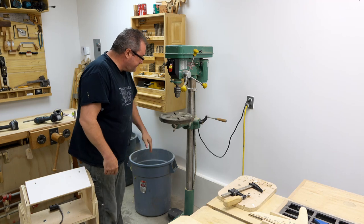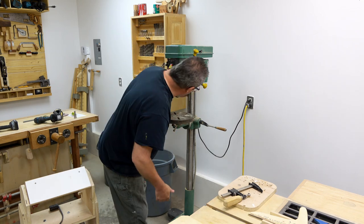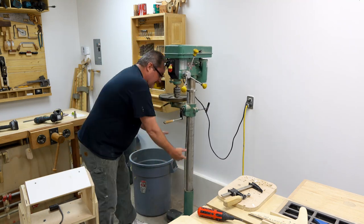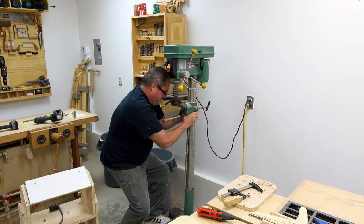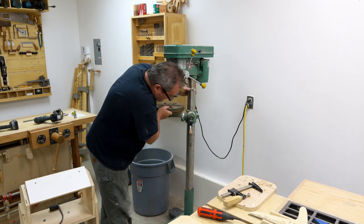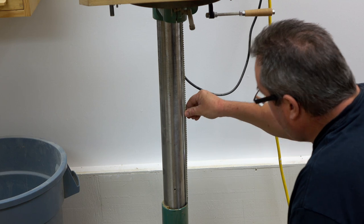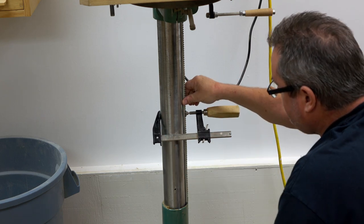I'm going to straighten out that rack again. I need to loosen this screw that slides up and then bend it back — this should be hardened so it can't bend like that, it's totally crap. Once it bends it goes all kinds of wavy. That looks a bit better. This is the kind of thing that works great on paper — it's still not perfectly tight against the post and it never will be, so I'm going to put the clamp on there again just to make sure it doesn't pop out.